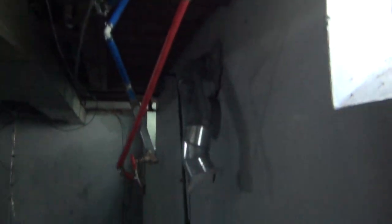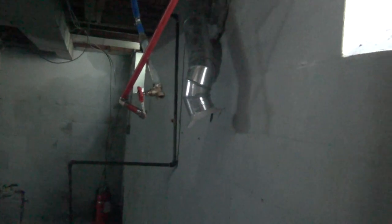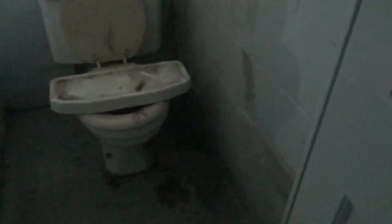There's also some missing plumbing by the laundry tub, so we'll test all plumbing throughout. Galvanized pipes appear mostly intact. Drain covers needed where missing. The shelving unit and all leftover stuff in the storage closet need to be removed. There was a half bath down here — really just a toilet — so we'll eliminate that, cap it off, and remove the surrounding walls to open things up.